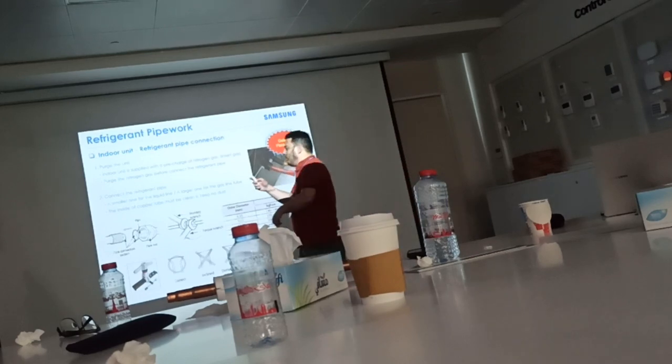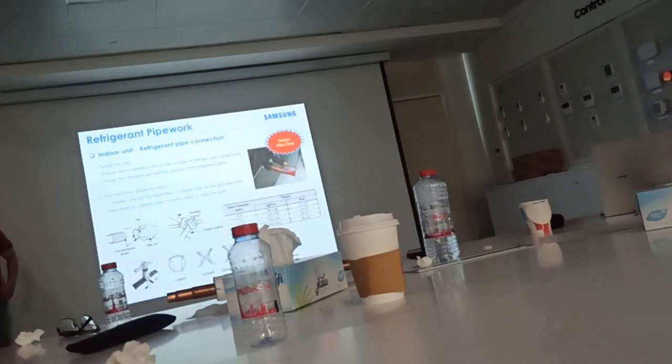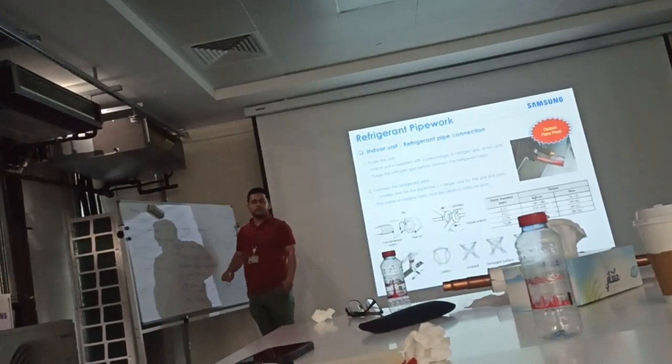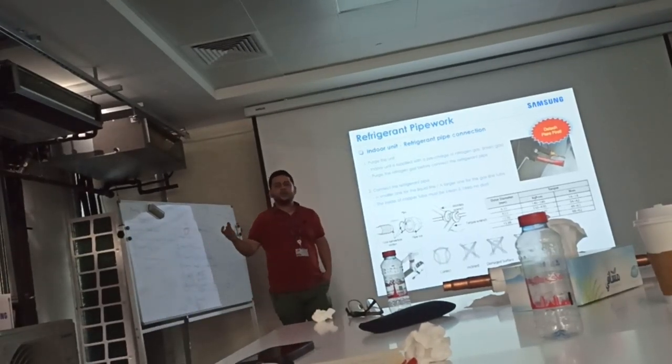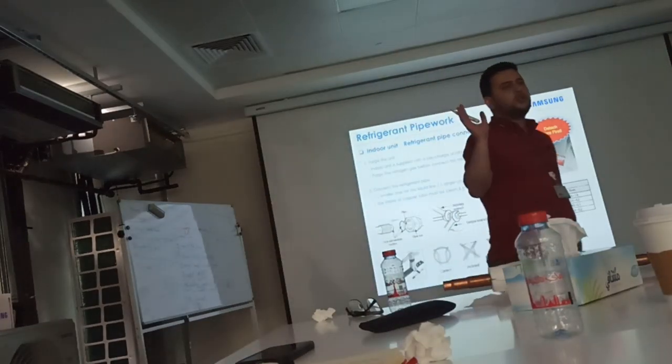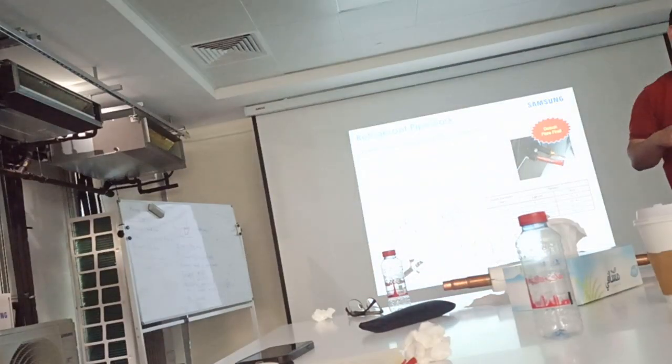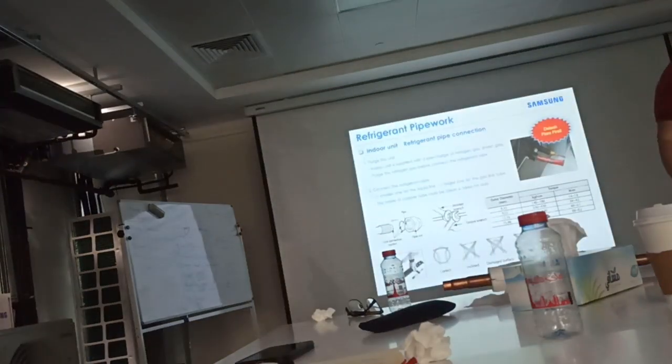When the pipe is entering the floor, okay, from the shaft. This is the shaft, the pipe coming vertical, and then directed to the floor. And at this point, you might have elbow, right? 90 elbow. This elbow should be supported with angle. Okay? Should be supported with angle or another way, but it should be supported. Most of the time with angle. Okay? Because it will have the highest pressure in the system, this point. So it should be supported properly.